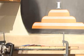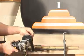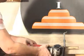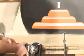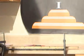The next grit will be the 300 grit. Attach the 300 grit and begin to polish from left to right. It is important while flat polishing to hold the grinder at a 90-degree angle as you move through the grits. This will make sure that the flat polish remains just what we call it, a flat polish. Holding at different angles will result in an angled finish, not desired for this process.